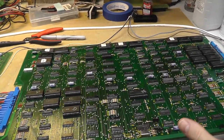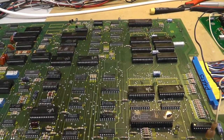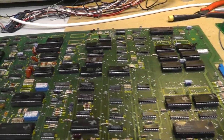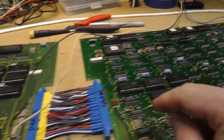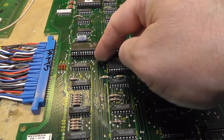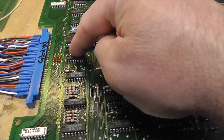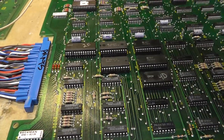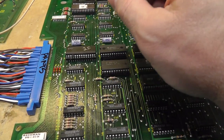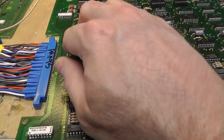I don't know if those are the best things to do — RK Jason says you probably shouldn't use the Dremel — but I kind of like doing it and then applying DeoxIT. The only thing is: this chip at 2F is one of the reasons I like removing all the chips. It has a machine socket, and the chip legs were very oxidized. One of the chip legs actually fell off when I was using the Dremel — if there are weak legs, the Dremel will break them off. The rest were fine.